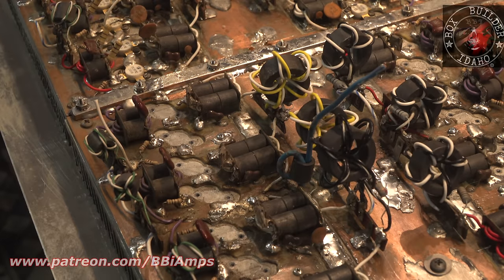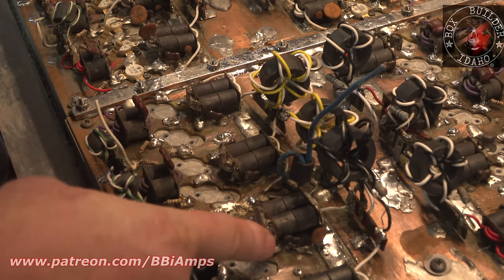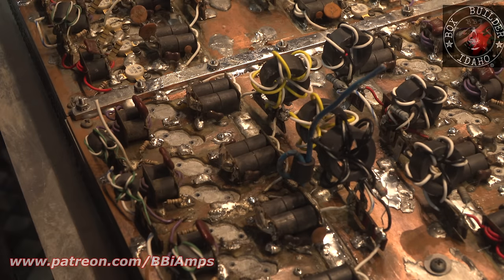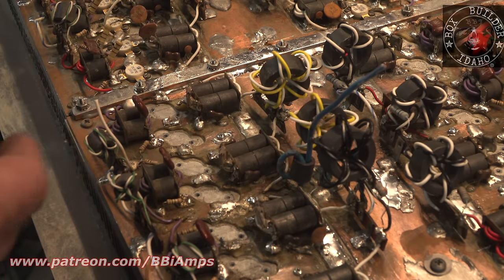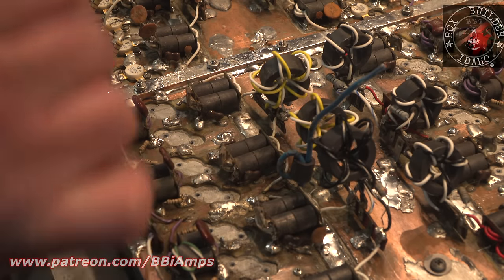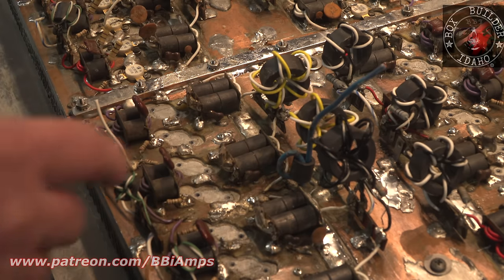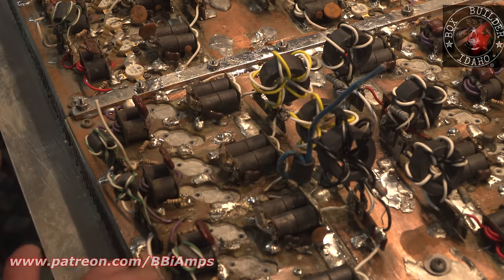The reason that trace material is so vitally important is because if I have a blob of solder that's attached to the front of the transformer, and that blob of solder is blobbed up enough that it maybe makes contact with the tab of the transistor, who's to say that that doesn't all break and we have a cold solder joint and we keep blowing a pill here? So somebody goes and they change a transistor and they blob more solder on top of bad solder with this all full of corrosion and dirt and filth, and we get more problems.